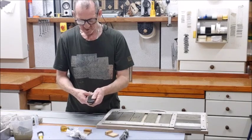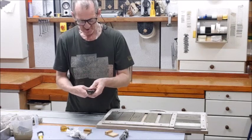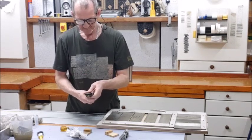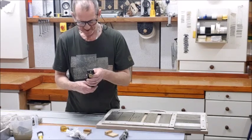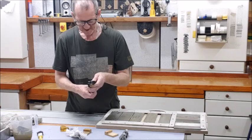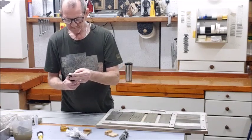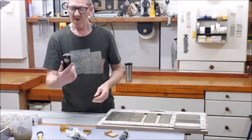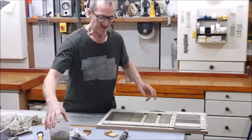Back it off. With old planes, back them off until you're just protruding. When you're just protruding you should feel the sharpness at both ends evenly. And that is beautiful — back it off, pull it out, and that's it. That's your block plane done and your bench plane done.